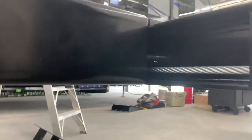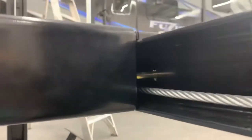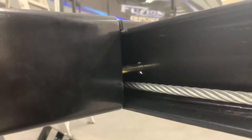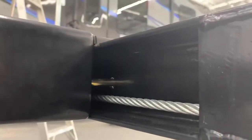The other big thing to watch when moving these ramps: inside the ramps are the pulleys, and these pulleys will actually stick out into the crossmember about an inch to an inch and a half, because that's what the cable is lined up with. So when you're setting these ramps down onto the crossmember, be careful not to just drop them, otherwise you'll end up hitting the pulleys. They're pretty beefy so it might not do harm, but it wouldn't be good. And the same thing applies when snaking the cable through — be mindful that those pulleys are sticking out.